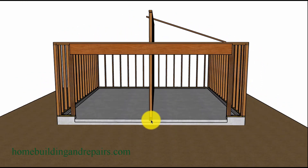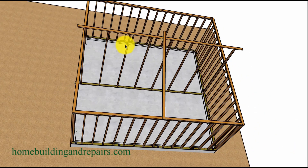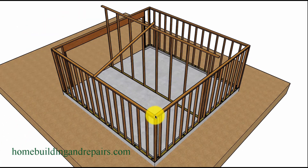The first thing you're going to want to do is build a wall level at the top and locate it in the center of whatever you are building. This wall can be any height. If you want it to be some type of a roof pitch like a 4-in-12 or a 5-in-12, then you'll have to do the math on that.